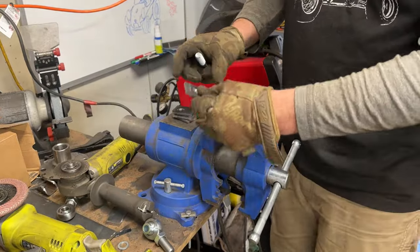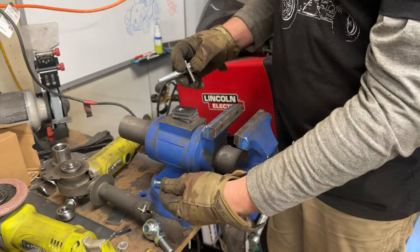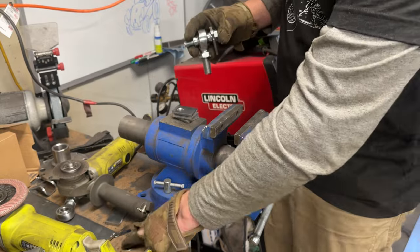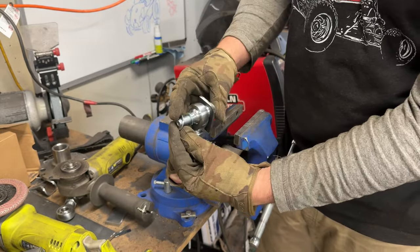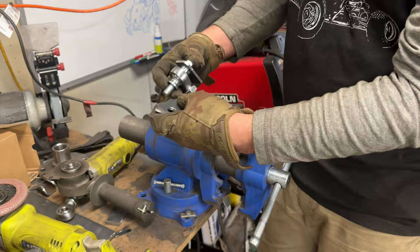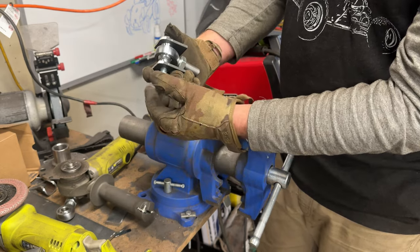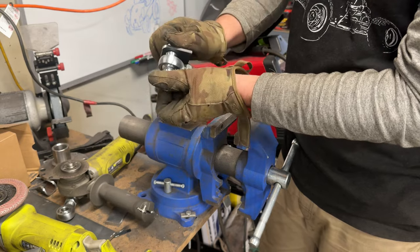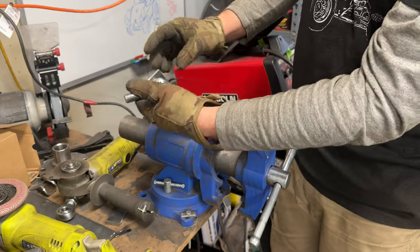All right, now before we cut the box part, I'm gonna give you guys a super hot blazing tip. If you're gonna have your cart powder coated, there is a thickness to powder coat. So what I do is I take a washer, like an 1/8 inch washer, and I will put it between all of my brackets, tabs, whatever you wanna call them, before I finalize them. So this is what we're looking at right here.